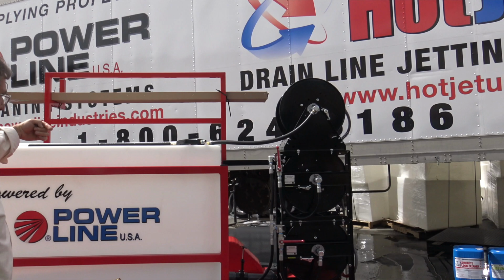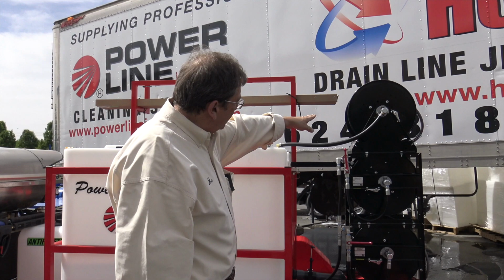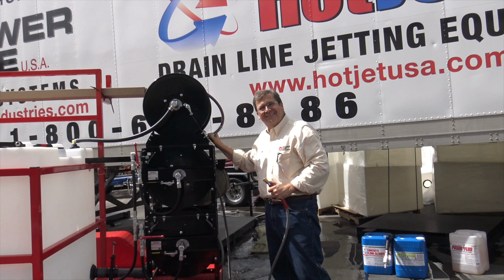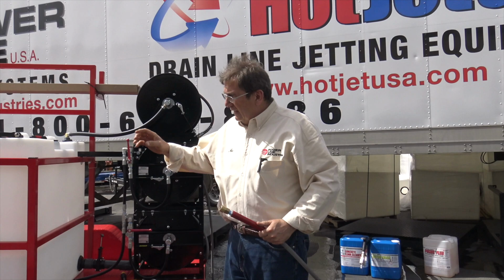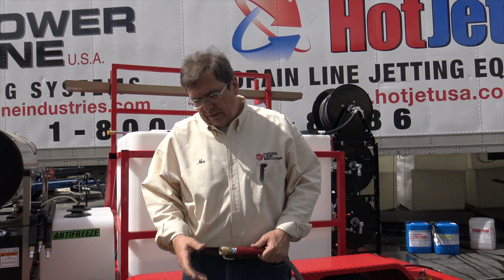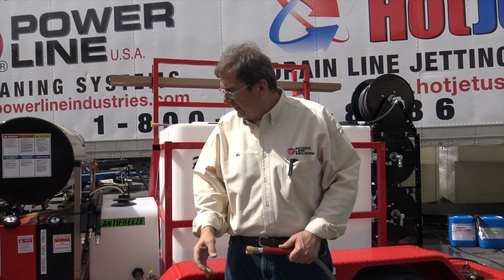Now, the hose up here, you're gonna need to blow it out. Or call and ask Steve for a little connector that'll hook right here to here. There's some more phone calls for you, Steve. He's pretty good about all that. So, if that was full of antifreeze, we would run the whole system right there in that position until antifreeze comes out the end of the spray wand, or the end of this. Let go of the wand, shut it off, shut the engine off. That's how it works. Works great.